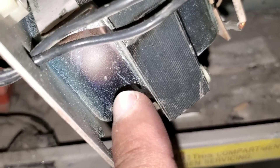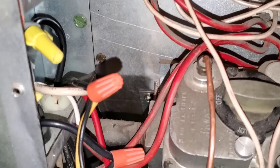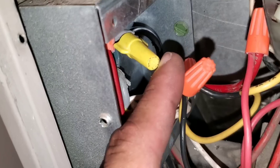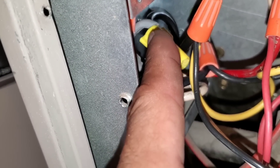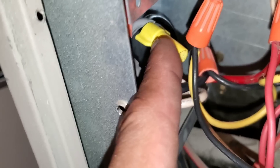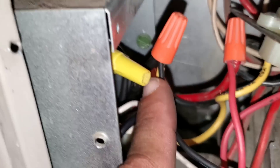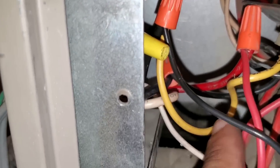This is your transformer. Looking just at our door switch: you have 120 volts coming in. In the closed position, that sends the incoming 120 volts from my outlet or breaker back down to my switch, and since the switch is in the closed position, it sends the voltage back up to supply power to my transformer. It will also supply power to my fan relay.